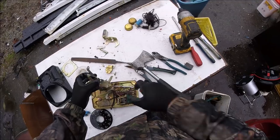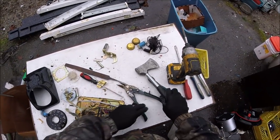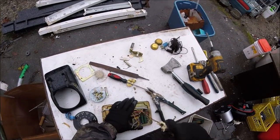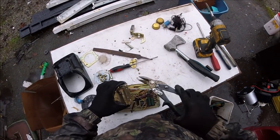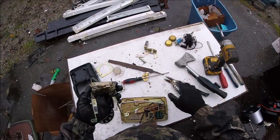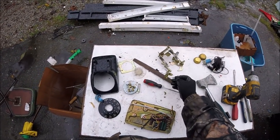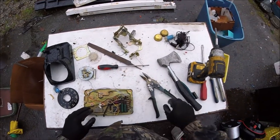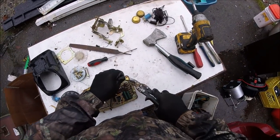Because anything prior to 1970s was all a lot of PCBs. Same with transformers. You might get a transformer. It's not oil inside, but it's oil on the paper. And I watch guys on YouTube take transformers apart, really old ones, not realizing the paper is soaked in PCBs, right? So you have to really kind of be careful on certain things, hazards in plain sight. You wouldn't even know.